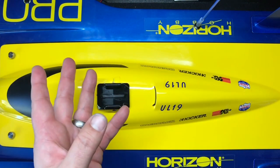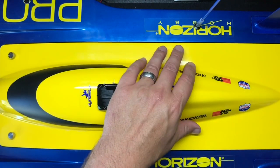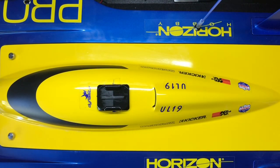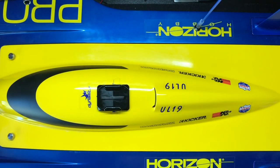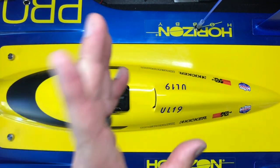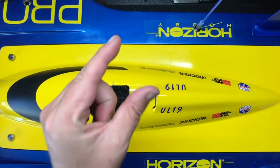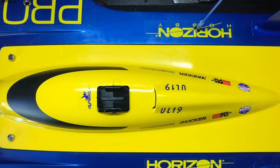The other day when I was out in my travels, I found this really serene, calm lake — you guys might have seen the video. I dropped some 5S in here: a 3S on one side and a 2S on the other. The thing was humming along, going really good. It was FPV. I came into shore at the end and it just stopped. A couple people asked if the batteries only lasted three minutes — no. The batteries were still charged. It was the fact that it got so hot that the XT90 connector — it didn't melt, but it got so hot the solder came undone.